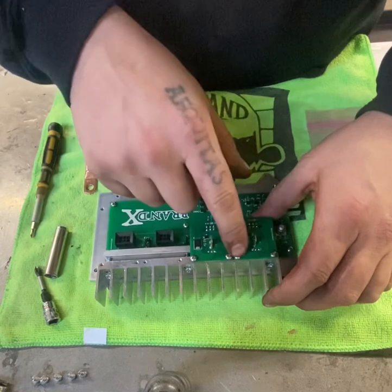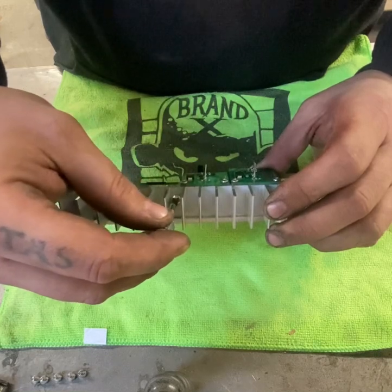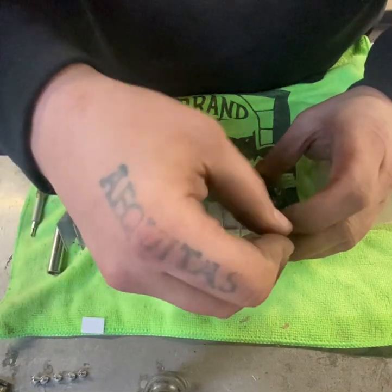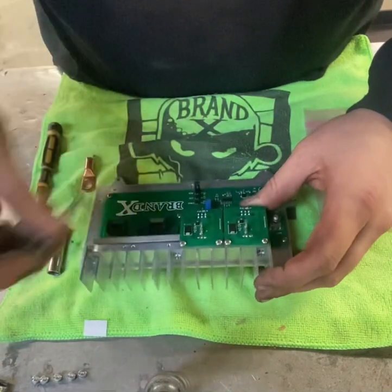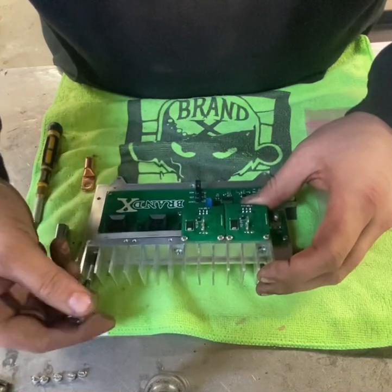You do not need a lot of force to put these in. I do recommend assembly with blue Loctite. You'll then retighten your bar — it doesn't need a ton of tension. There is a spring on the center screw that actually maintains tension for you, so you don't have to over-tighten it.